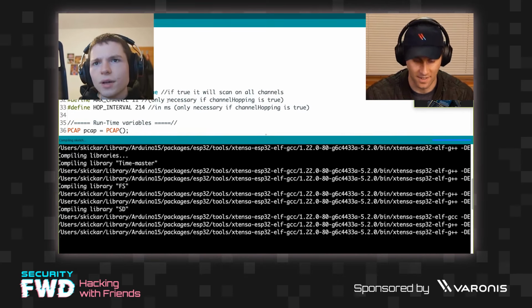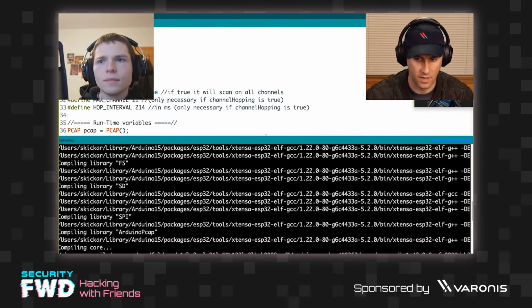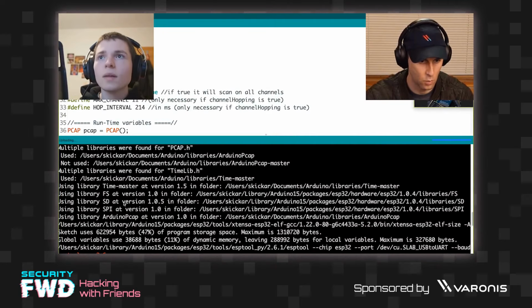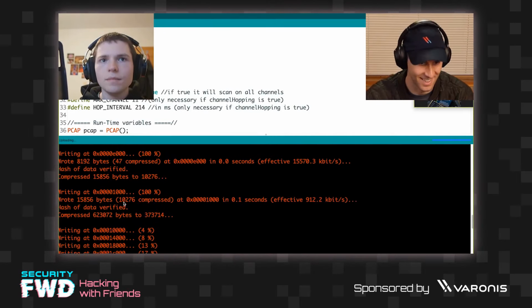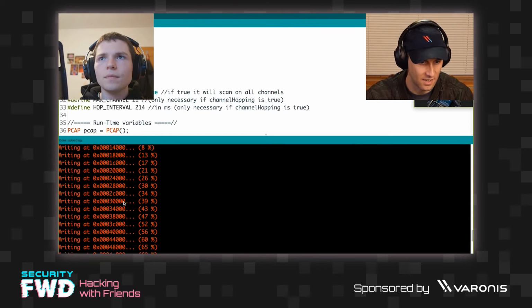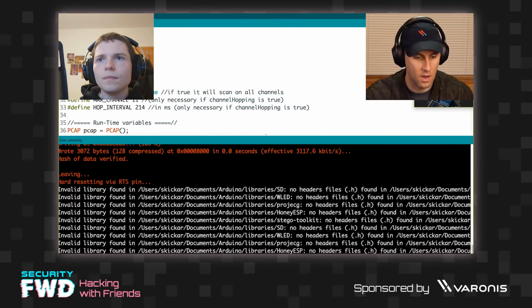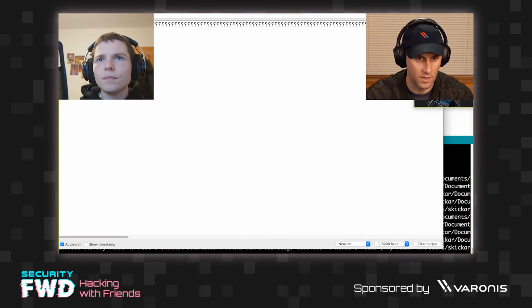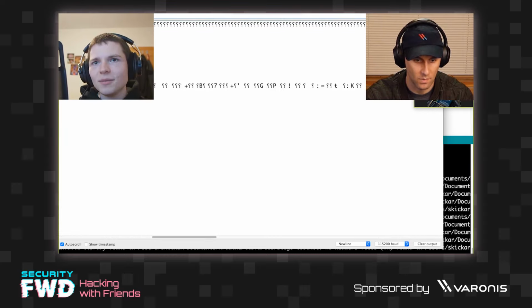I just had 115200. That's safe to use. I'm going to try the same thing on my end. Cool. Just gotta flash this thing all over again, which fortunately happens a lot faster than the ESP32, I think. Yeah, it's done. Okay, cool. So now I'm gonna do the serial monitor. What can we see? Oh, a bunch of question marks. More question marks. Let me see what I get.